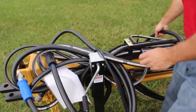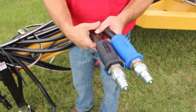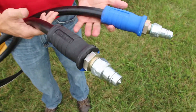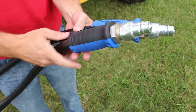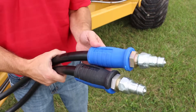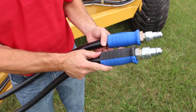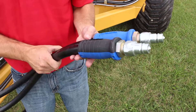The next set of hoses we're going to talk about are the main hoses. There are two sets of these. As you can see, this one is the blue set, blue handled. This handle here is half blue half black. The solid color is your return line for your tractor. The split black with blue or black with red, that is your pressure side.